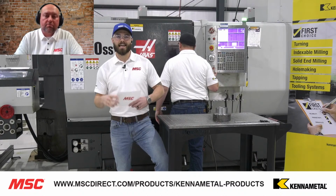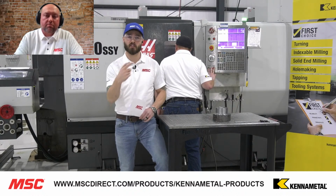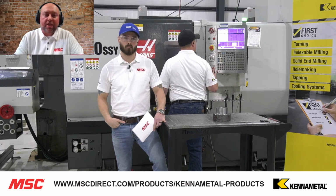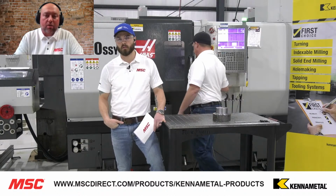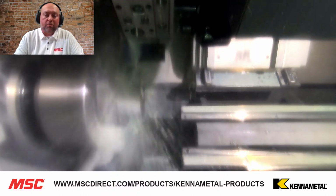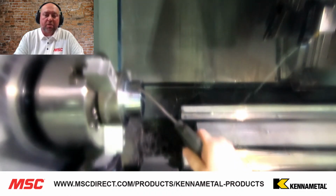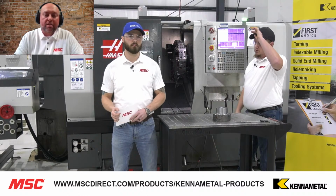Interesting. And outside of increasing the speed, are there any additional benefits to the new school method as opposed to the old school that we saw just previously demoed? I mean, that's really what it's all about, decreasing that cycle time and getting more capacity out of that machine. In the roughing operation now on this new school method, we're running at almost 29 cubic inches a minute of metal removal rate, which is about 5 times higher than what we were doing previously. And in our finishing application, we're running about 4.5 cubic inches a minute now at those parameters. We're getting ready to jump over to the finish. It's really about getting that part out of the machine as quickly as you can, but with a quality part.